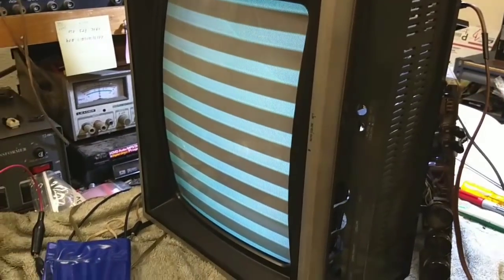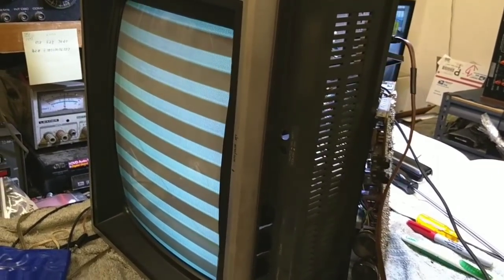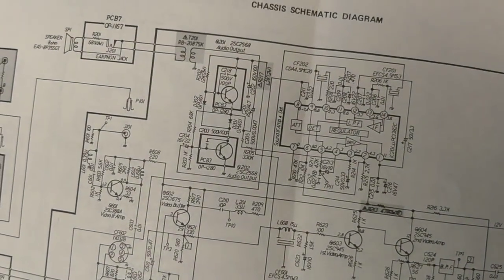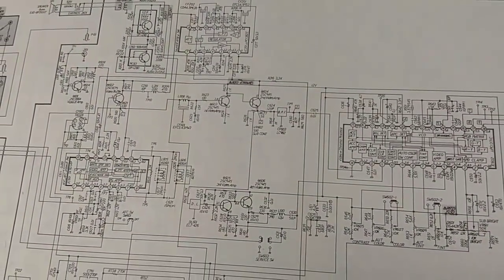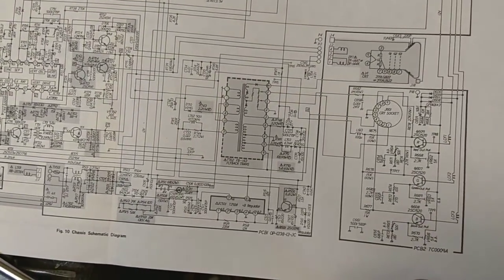The fact that my color is all gone now — I might look at voltages on the color killer, but it's very strange. All the voltages on the jungle IC here are within spec, maybe about a half a volt higher than what they say, but that's because our line voltage is a little high. The IF is working and I'm getting what appears to be good waveforms coming out of the IF IC and video amplifiers.